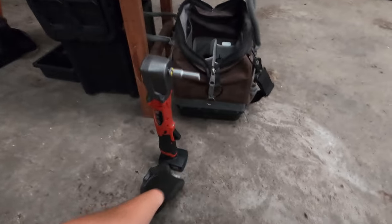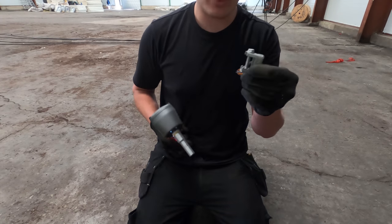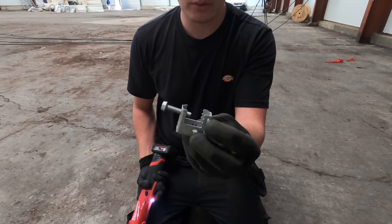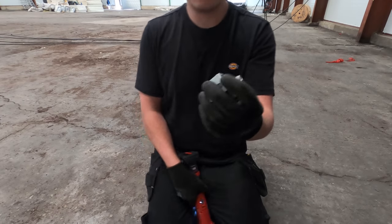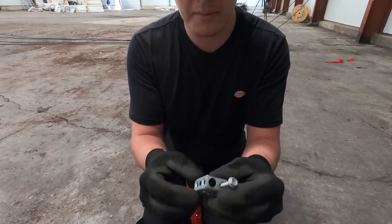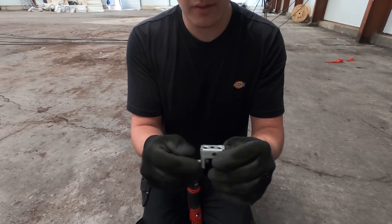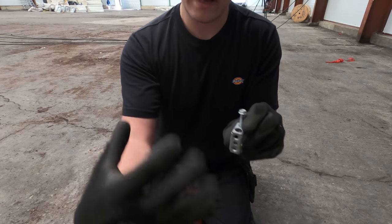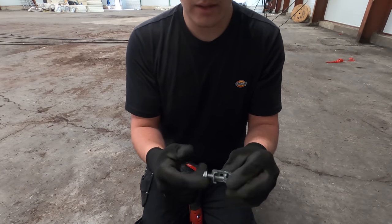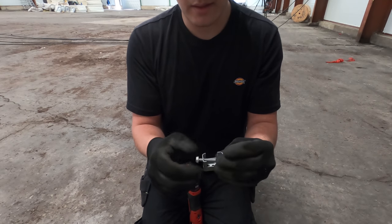We're going to pull in a 4mm supply to that roller shutter door — proper overkill, but they might change it for a different door, just trying to future-proof it. There's another door over there which will need another 4mm supply, just a 16-amp circuit. The G clamps, if you haven't seen them, are these — just by Wallraven. The beauty of them is they're really universal because you just tighten them down onto whatever you want. They're metal with little teeth so they easily bite into steels or girders. They've got 6mm threads so you can mount all sorts to them.